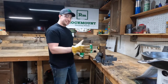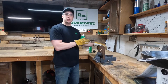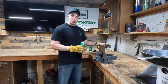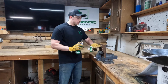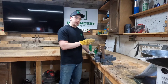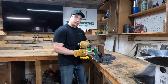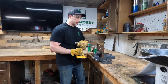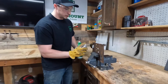Now that you've seen what it can do with the drill press, we'll show you how it works with a hand drill. The drill press demo used a 3/4 inch hole cutter and now we're going to work with a 1 and 1/4 inch hole cutter. Keep it cool by using our cutting fluid — give it a spray on your working surface. One key thing I've noticed: if you give it a little walk, moving the drill bit slightly, it gives you a nice clean edge and helps those tungsten tips really work with you.